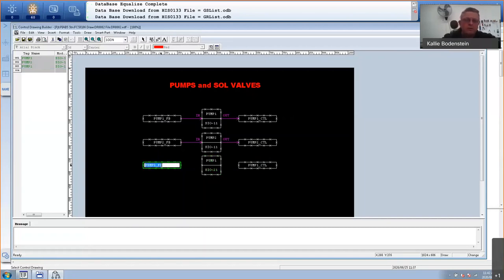I need to change this. Now I need to remember what the feedback signal of that valve was. VLV002 open feedback. That is the name I've given the open feedback. And this will be VLV002 control. VLV002_control. And I will now wire this. And I'm done, but there's supposed to be two feedbacks, open feedback and closed feedback, but I'm done.